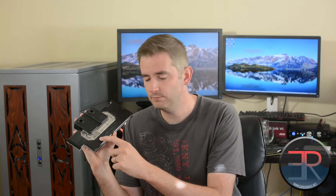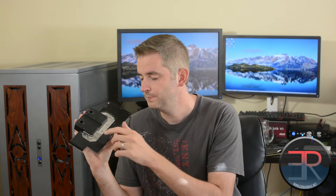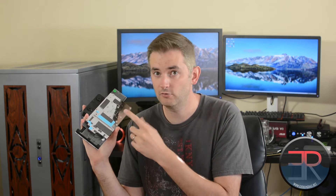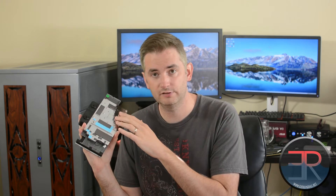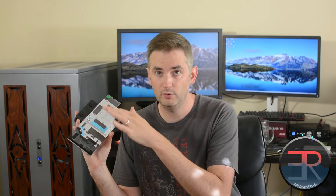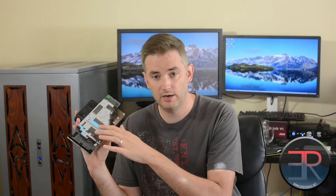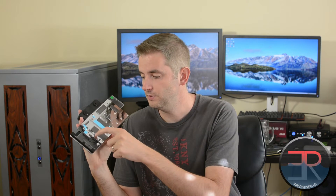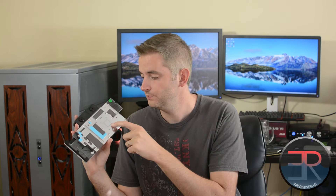The surface of the block is a brushed aluminum finish. Underneath, the cooling is actually copper — it looks like chrome because it is chrome plated. Some manufacturers use nickel plating instead for this silvery look, but chrome gives you a bit more of that polished and clean look. You'll also see two different kinds of thermal pads — some blue and some browny-gray — covering the VRM section, some other random chips, and the memory modules, with the graphics core in the middle.